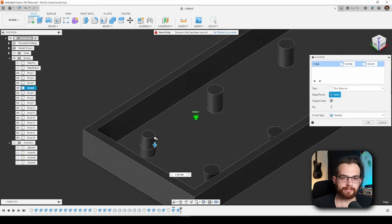After each switch has a diode and all four rows have been created, I'm going to start creating the keyboard's columns. The key switch legs that were not used to form the rows will now be used to form the columns. I'll be using a different colored piece of wire for each keyboard column. No more diodes are required for this part. It looks like this keyboard will have a total of 18 columns.